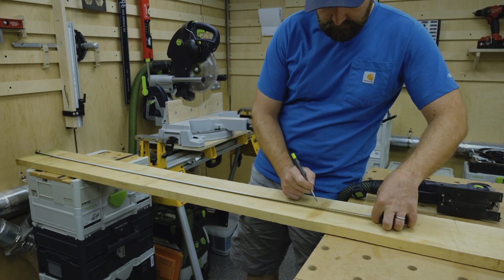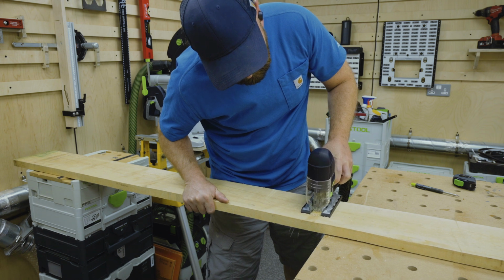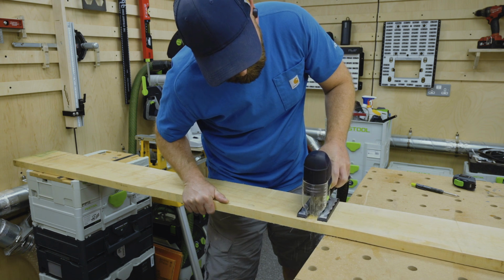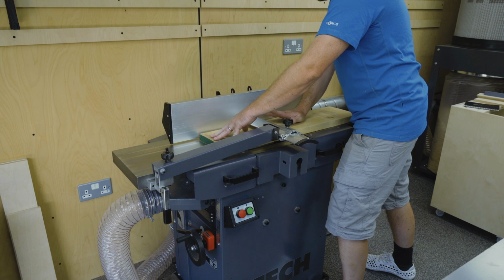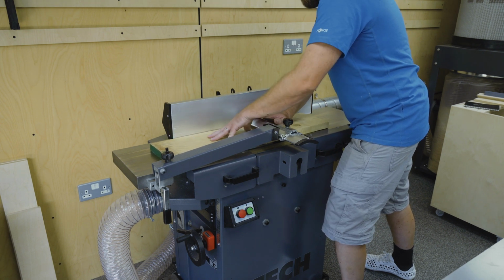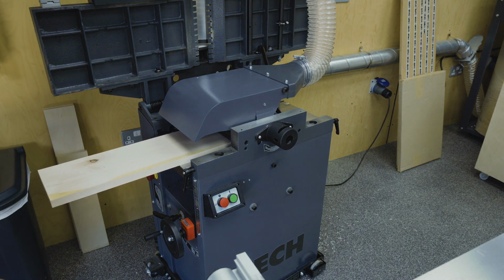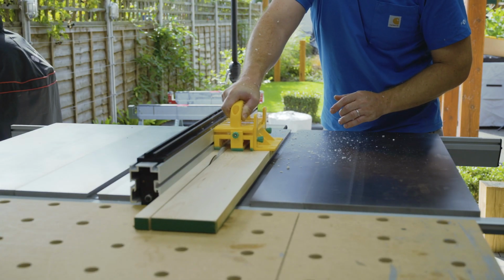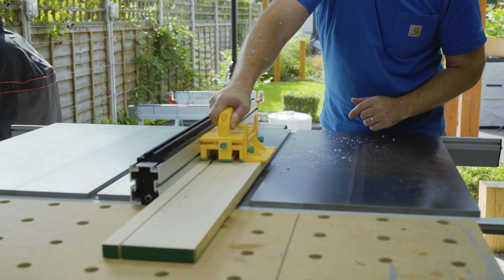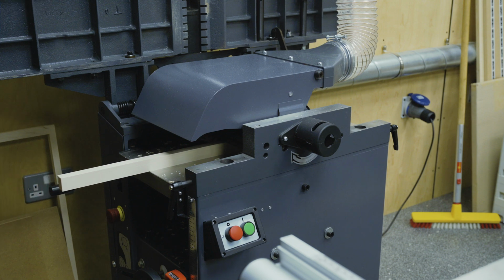With the cabinet assembled, we can move on to milling the maple for the face frame and the bumper. Doing all of these parts together in a batch will save time, as all the parts share the same 20mm thickness. Given our maple parts are fairly small across the grain, you will want to make allowances for movement after milling and ripping. I left 5mm in both width and depth after the first round of milling, then came back a day later to get to final width and thickness.